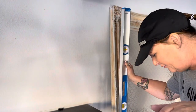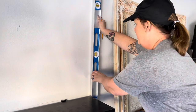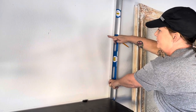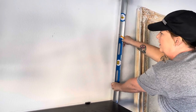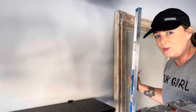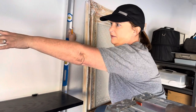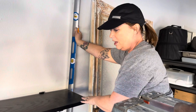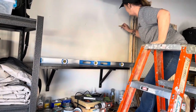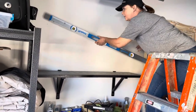The first shelf is up. For the second shelf we want it directly above it, so an easy way to do that is basically go to the edge of your shelf with your leveler and make sure this is level at the top. Then we want the second shelf to be roughly around here — I'm just going to do a little pencil mark. We know where the shelf is going to end directly above this shelf, so I now just need to measure 47 inches — the length of the shelf — from this point going that way. I'm using the leveler to mark a straight line between these two points.